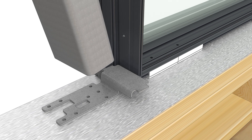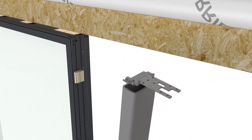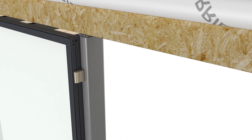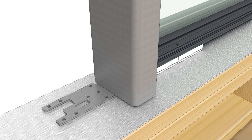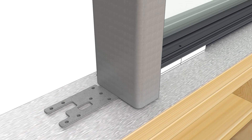Set the bottom of the mull tube on the sill bracket. While holding the top mull bracket in the top end of the tube steel, position the steel tight against the mull filler blocks. Clamp the tube steel to the assembly. Adjust the frame and sill bracket until the frame is on the correct exterior plane and the bracket is square in the opening.